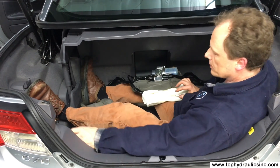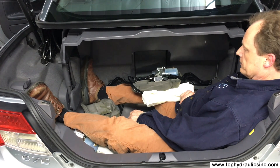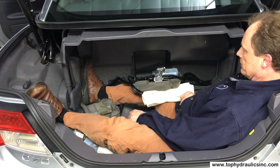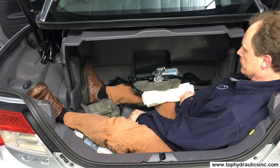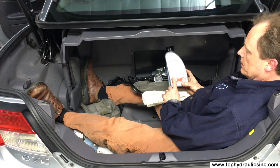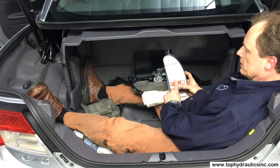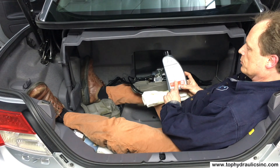Now let's talk about hydraulic fluids. You can buy a Volvo fluid, which is identical to Pentosin CHF-202. You can also use Pentosin CHF-11S, but I personally don't like it because it has a very offensive odor and it tends to corrode clear coat if you spill it. My favorite is Febi Bilstein part number 02615, which is the generic identical fluid to what's used in Mercedes-Benz, BMW, and Porsche.